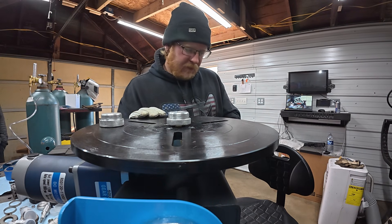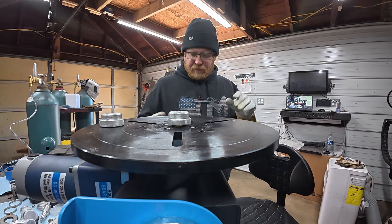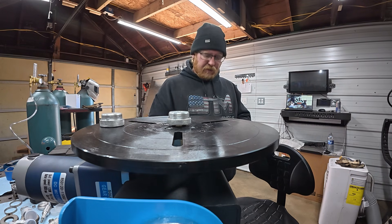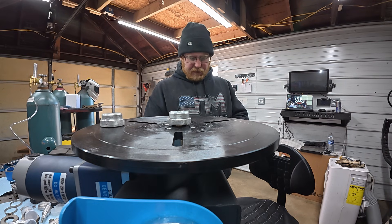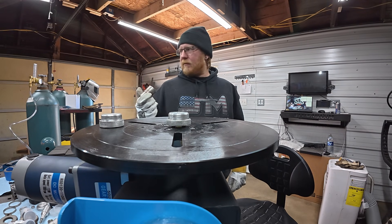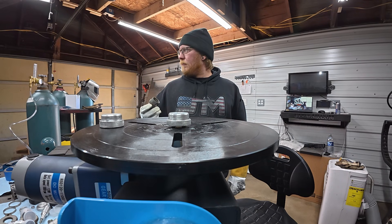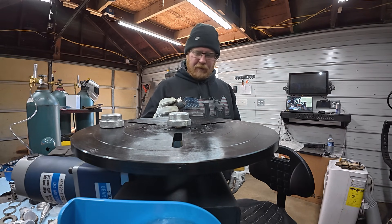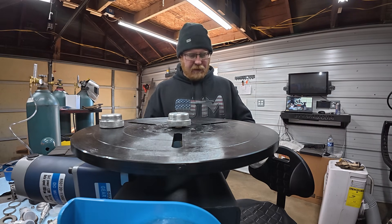When you first start in the middle of it, those other ones I've used sometimes work, sometimes they don't. Only did the one run on it so far, but it seems to be a really good machine. We're gonna run a couple more and see if we can get the settings a little bit better, to get 100% penetration on a piece of exhaust pipe. This is about 16 gauge, around 63 thousandths wall. So we're gonna run a couple more and let you watch.